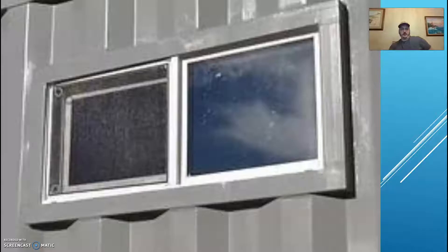One of the big discussions we had is what are we going to do about the window and door frames — how are we going to waterproof them? I'll show you a couple of examples of how other people have done it and then what we've decided to do. The most common approach is metal or wooden framing around the window — just pop it right in, paint it. If it's metal, you weld the whole seam; if it's wood, you put caulking on top. Waterproofing becomes a problem because of where the indents and corrugated steel are — you have spots where water could pool up, and if your seams aren't perfect you might start getting water in the home.